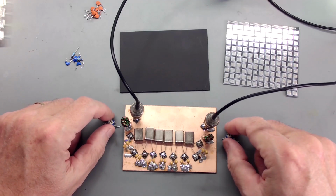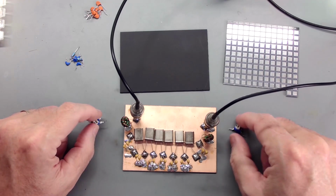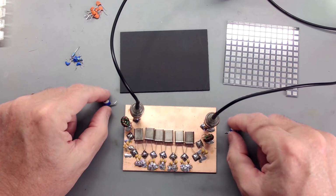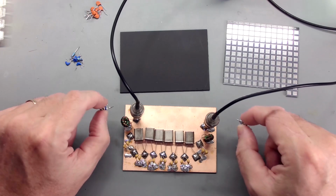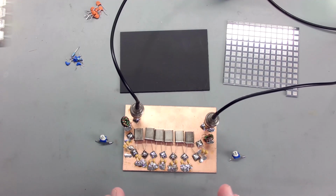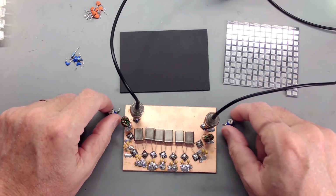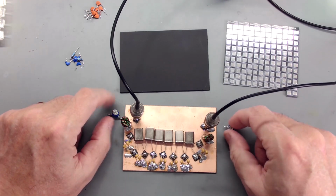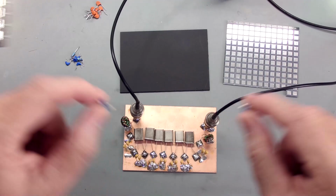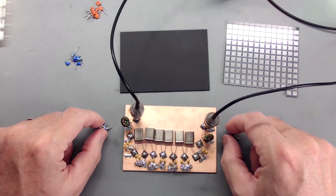And then, of course, I quickly desoldered these and took them off and measured them. And to my surprise, the Nano VNA said it was 134 ohms. These were a few ohms apart, but the average of them was 136 ohms. So that was just a verification cross check of this technique compared to the VNA, and I was literally shocked at how close they actually came out. I could have fallen off the chair. I couldn't believe how close. I would have expected it to be in the ballpark, maybe 15 ohms, 20 ohms one way or another. No, they were very close, within 2 ohms.